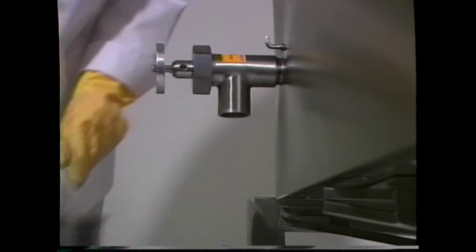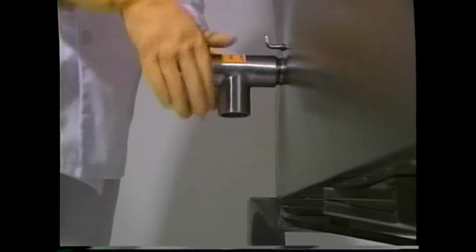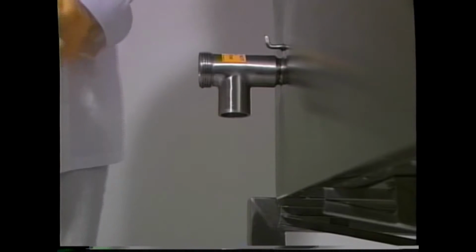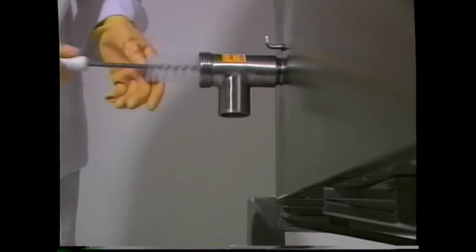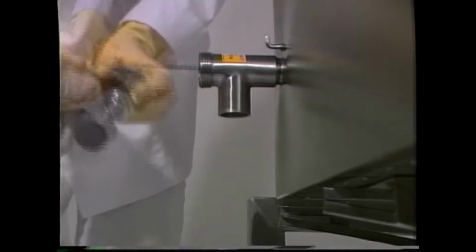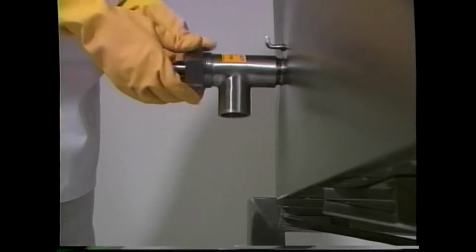When washing, excess water in the pan may be drained away through the draw-off using the optional drain hose attachment. Once the water has been drained from the pan, take off the drain hose. Making sure the stem is in the open position, remove the nut and the stem from the draw-off faucet and thoroughly clean the body and tube using the draw-off cleaner brush provided with the Care Kit or any similar brush. When through, rinse with clean water and reassemble, taking care never to over-tighten the draw-off.